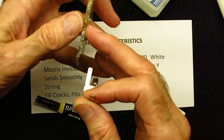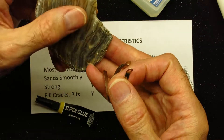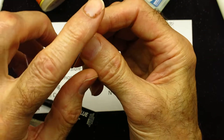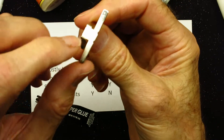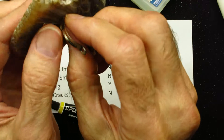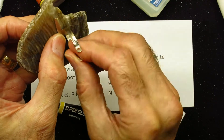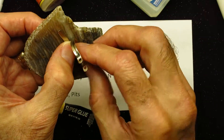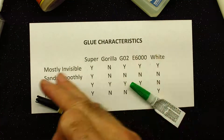At the very least, I would wash it with a dish soap like Dawn that's good at removing oil. You also want to clean the other surface with alcohol to get anything off of it. I usually sand it lightly to make sure it's a little bit rough — take some of that gloss off. And then you want to be sure that the surface contours match as perfectly as you can get them. You may be able to see this one kind of wobbles back and forth — I haven't straightened it out yet — so you want to get that nice and tight.